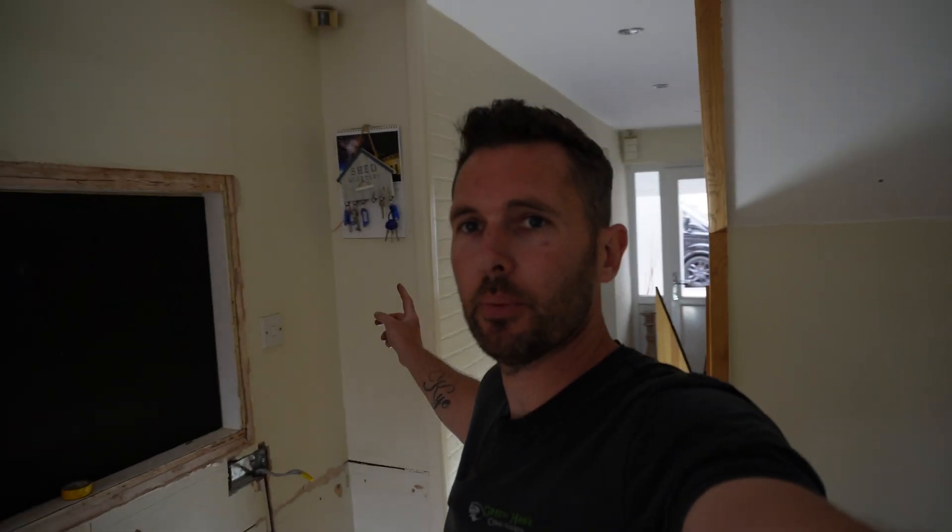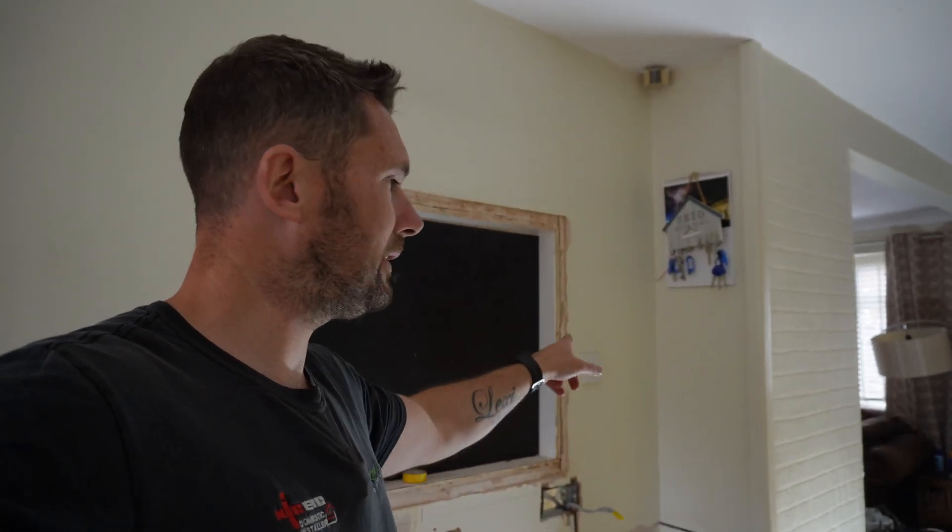Jury's in - the ceiling's coming down. We haven't got enough dust sheets to cover all of the oak flooring and leading into the open plan living room, so we're going to pack up now and be back tomorrow. Doing it this way is actually going to be a little bit better because I can move all the light positions around. I'm going to get rid of all the wireless switching for the undercabs and the plinth lights, because then I can put a loop feed down to the light switch and do it all from there.